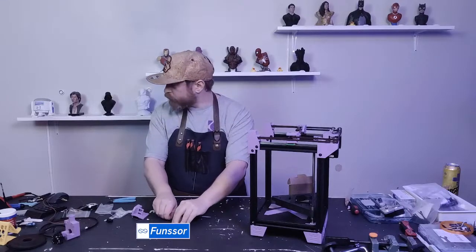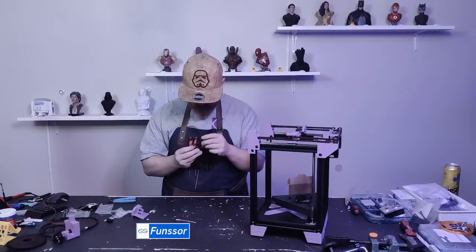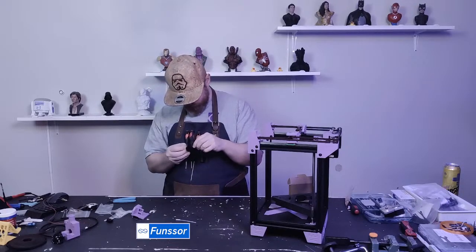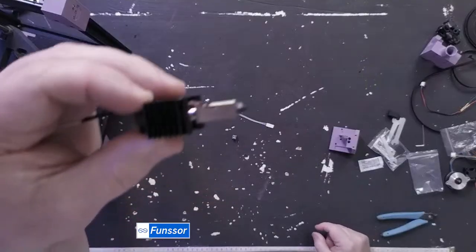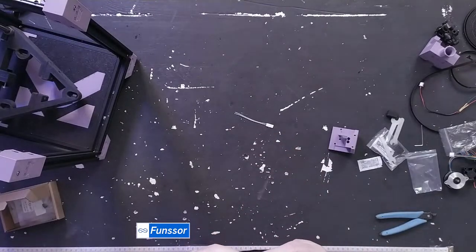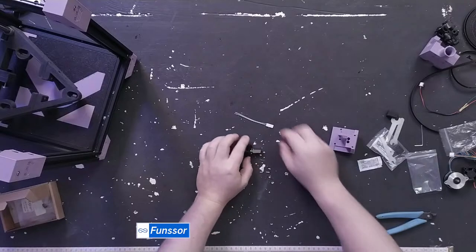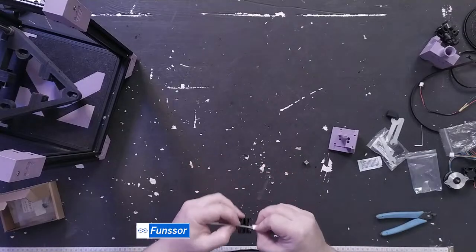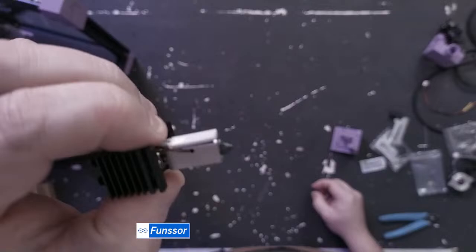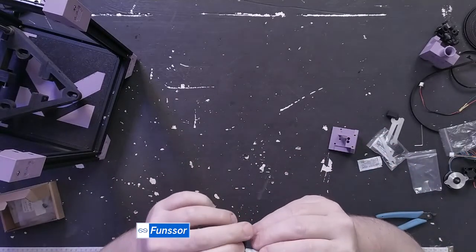The thing that I'm mostly confused by is where the thermistor goes. There is a hole. Does it just go in that hole? Is that correct? Does it just hold on like that, and then the clip secures it? The smallest little hole, yes. So then I need to goop this. I'm just doing a dry fit right now. I'm learning, right? That's what I like to do. So that goes on there. Focus. Yep. And then this should slide on, right?